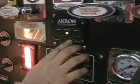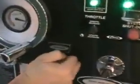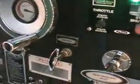Last thing was closing the pump drain. Another misconception is we should leave the pump drain open so that way people know that the pump has been drained. But we have a problem — if we go out and that freezes in the open position, we can't operate the pump. We don't have a closed circuit anymore. And once it's open and it's frozen open, we're done.